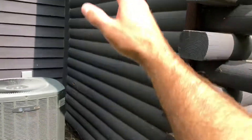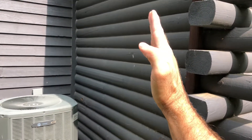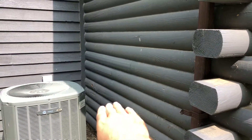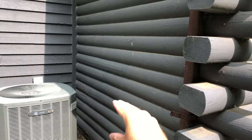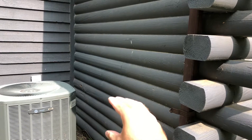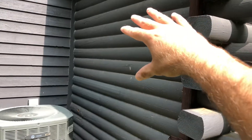Looking down the wall face here, I'm seeing a slight bow in this structural wall as a result of the rot that's down below. It's kind of like a crane — a crane moves a little bit at the bottom and a lot at the top, and a log home does just that. So when you have a little bit of rot down below causing some compression, a little bit of movement at the bottom results in a lot of movement up top.